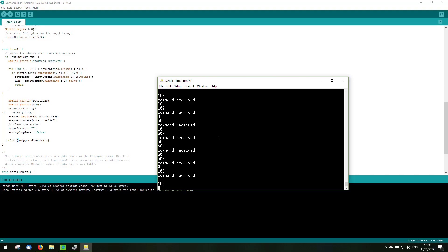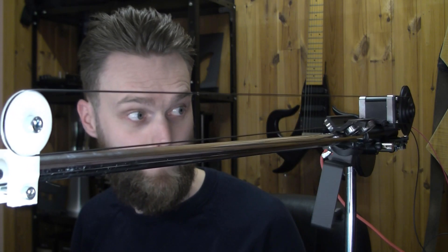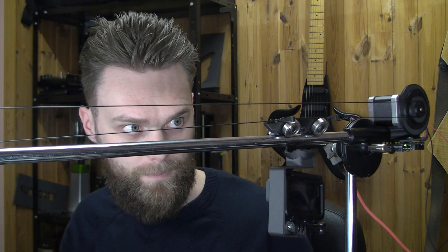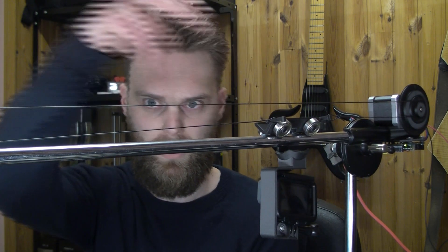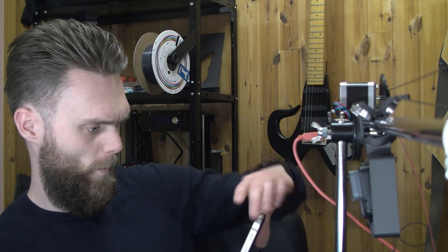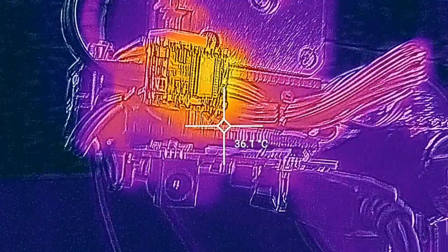Testing: minus 100, then minus 3 at 500 RPM, and now really slow — 1 RPM. That's 5 at 1 RPM, so it will take 5 minutes to go from one end to the other. Another problem is that the stepper driver is getting very hot, which I can show on the thermal imaging camera — it's above 120 degrees, so it shuts off automatically.